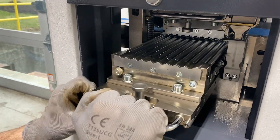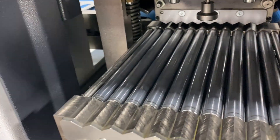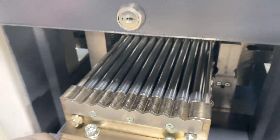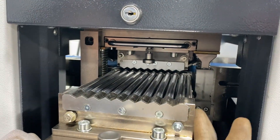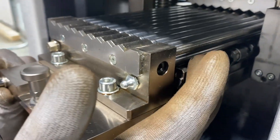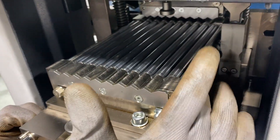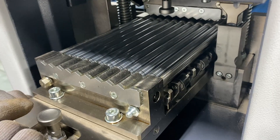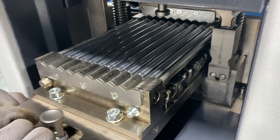We have a cassette top and bottom and I'm just going to pull it out halfway. You can actually see right in detail here — you have the leveling rollers that do the roller leveling, then you have the support rollers down here to basically counteract any kind of deflection. This is actually what we call a six-high configuration, so there's another set of intermediate rollers between the leveling rollers to eliminate any kind of dirt transfer.